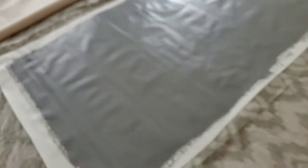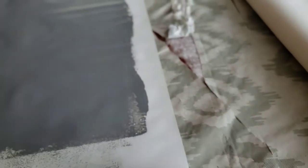And this was rolled very thick, and look, while it does have more texture than the first two, it's still not heavily textured by comparison to some paints that I've seen. And this, once again, we weren't even trying, just basically got the material on there and spread it across the top of the surface. We didn't thin it out or anything. And it's still, you don't have any kind of subsurface issues. You don't have any dry marks. Doing a soupy roll, you're not going to have dry marks. But you don't have any wonky textures or pools underneath that are darker than the top, things like that. Things you could expect even with a paint, not even using flat paint. I've seen people make some really bad mistakes with flat paint.